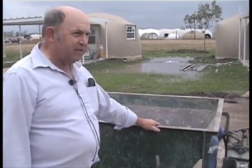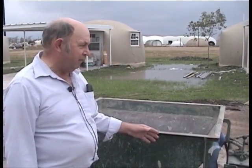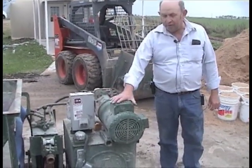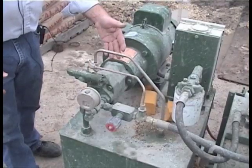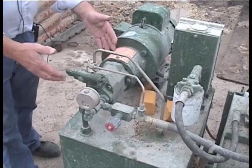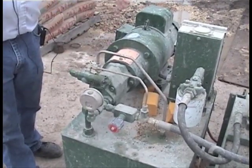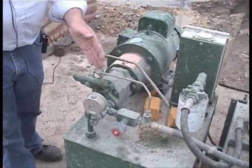This particular pump was designed specifically for the dome building process. It is relatively simple to operate, and the simplicity is what makes this the most valuable pump that we have. This EHP 1500 is driven with a three horsepower 220 single phase motor. We drive a piston hydraulic pump, which is the best for this system, because if you were to get too much pressure on your pump it will bypass the oil through this area right here.